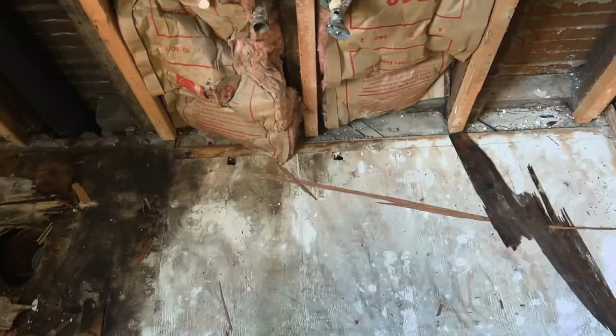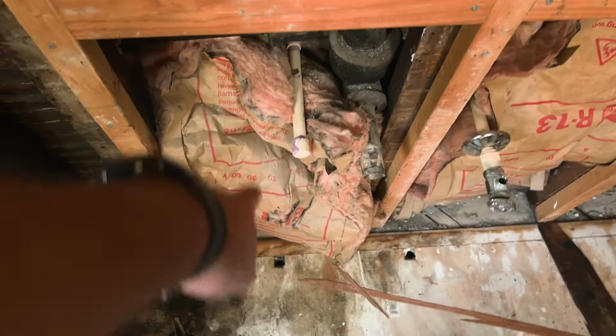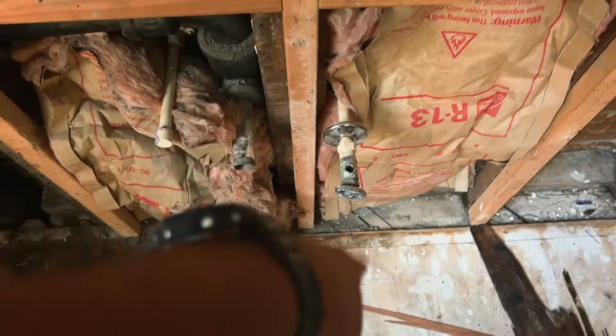And I'll probably still come out through the wall, but I like it to be more centered. You can see that this one is well to the left, whereas the cold's pretty much on the old center line. The hot was moved to the right. There's no reason for that. So I'd like them to be equally spaced.